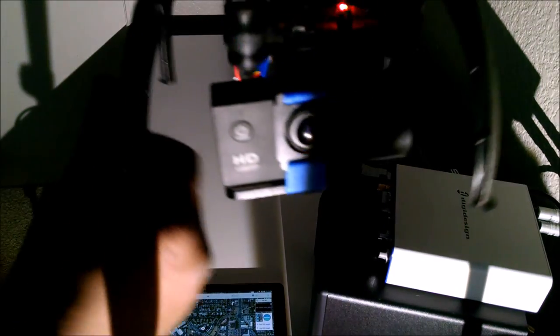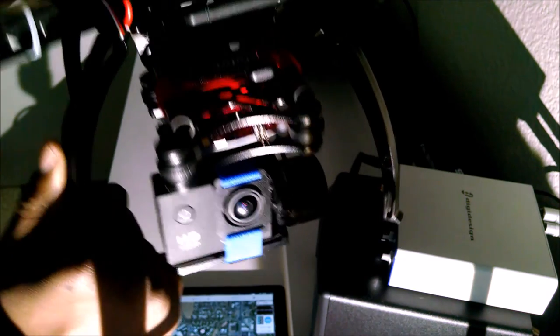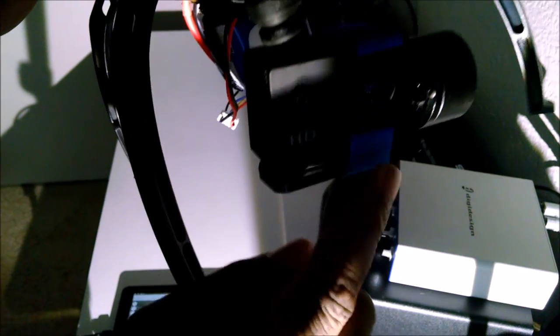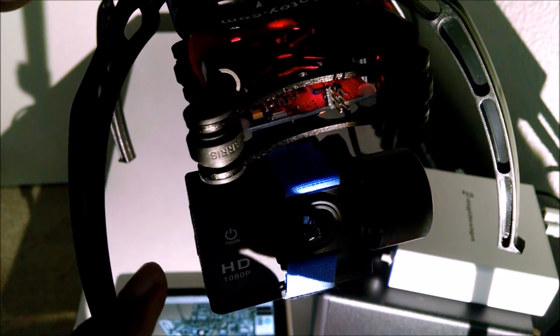As you can see, I can move the copter but the camera is staying completely upright. No matter what the copter does, the camera will stay in a stable position, keeping things very smooth. You do need to make sure that when you strap the camera down it is strapped in pretty tight, otherwise it'll sense vibrations and you'll get gimbal vibrations. If that happens, just turn everything off and make sure your camera is strapped down really well.